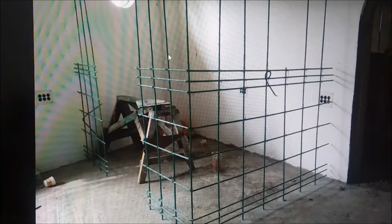That'll show us where we started the full 4-foot wide forms, because the rebars on those go in particular places, and they're exactly the same over the entire house. But at the last form before a wall, there'll be a space in there. It'll have a bar in it in the middle of that space, but we have to know where all the rest of them are, and we could pretty much draw on top of this skim coat all the rebars in the house if we wanted to. Don't care to, but we could.